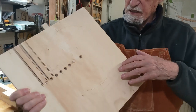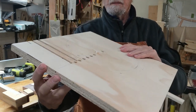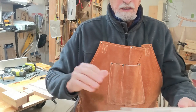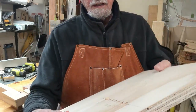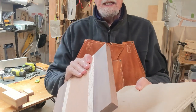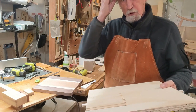That's this device — it's just a flat piece of 3/4-inch plywood. It's got a miter gauge strip on the back, and then it's got a series of hole patterns that I put in. What we do is combine these two things together and cut the circular patterns on the bowl, then we put them together.